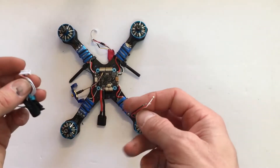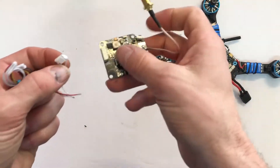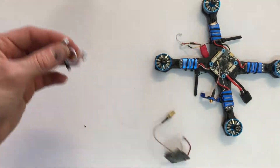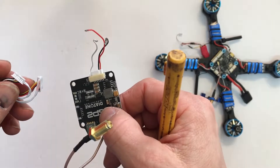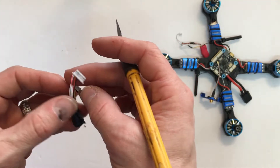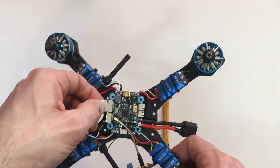For the next step, I'm figuring out the wires. This wire harness came off the SP3 — we don't need this anymore because the power for the VTX is already on the board, and the video is already on the board. All I did was use an X-Acto knife and lifted up the little plastic pieces to pull out the pins. So what I'm left with on this 10-pin connector is my buzzer, then power, ground, and video for the camera — that's all we need. That 10-pin connector goes right here. This pin is for the ESCs but we don't need that one, so all we're going to do is plug this in this way, and that powers our camera.